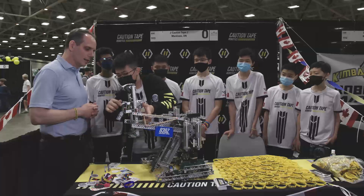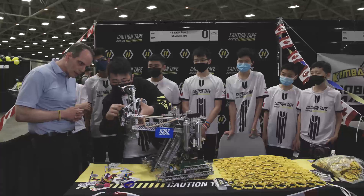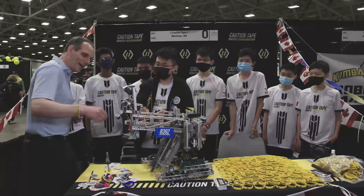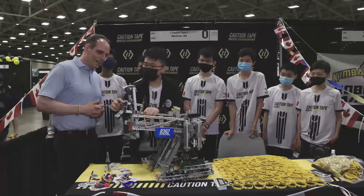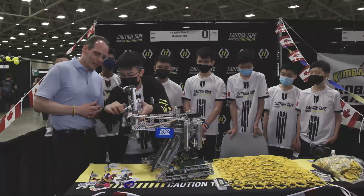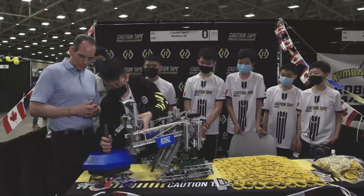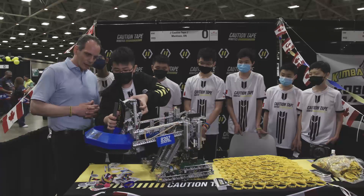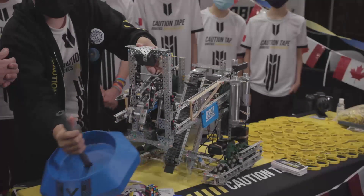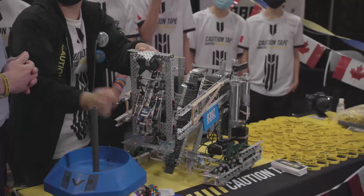What's also cool about this claw is because this reaches here, this is an irregular four-bar. So this is another four-bar here — that's so cool. So this four-bar keeps staying straight, while this four-bar will bend things. So it's angled like this, and when we have it down, it's going to be straight on the goal. If we look at the goal right now, it clamps down right on the wall. And when we have it all the way down, this is going to lock in place, so it's going to be really hard to get it out again without power.